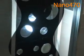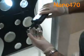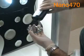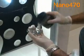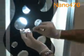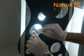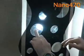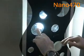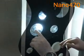But to speed up the process, while that one is curing, I'll check that we have the right size diameter, and I'll do 2 at the one time. Now if you over cure it, all it means is that your cleanup might be a little bit harder, because the residue from the adhesive has gone a bit harder on the outside, so you might need to scrub it a bit harder, or use a razor blade to remove it. Nothing worse than that can happen.